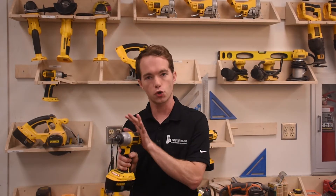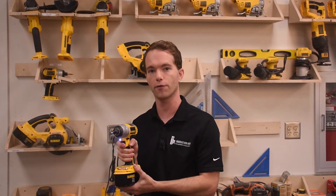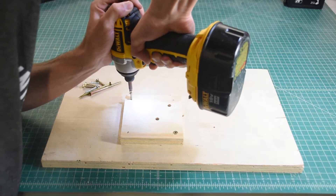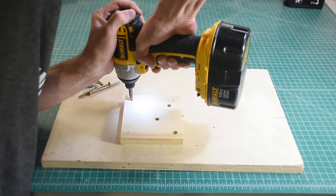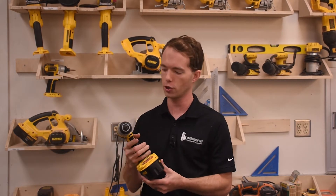So when you're new at this, or even if you're experienced, push really hard on the forward stroke and the reverse stroke and make sure that you pull the trigger very, very gently. This thing has plenty of torque. Once the torque builds to a certain limit, it will start kicking in the impact function. It may be a little surprising at first, but this helps drive screws exceedingly well. This is one of our go-to tools, but it's super simple to use.